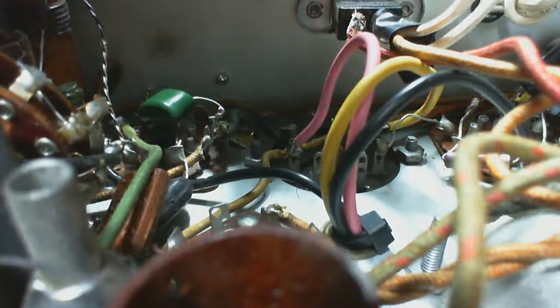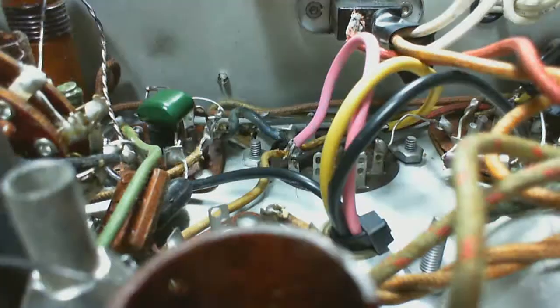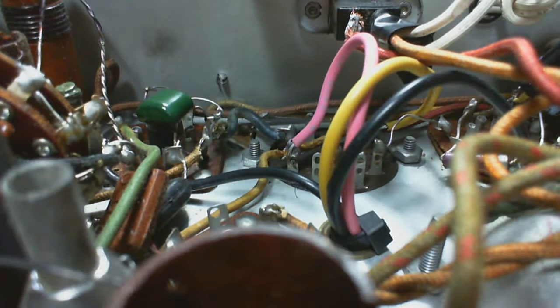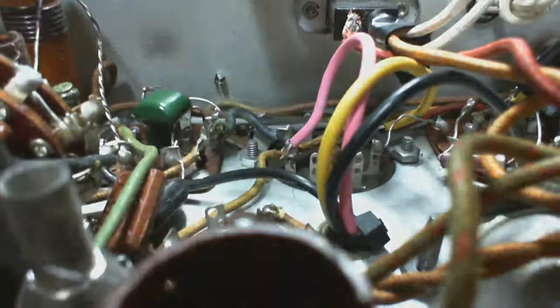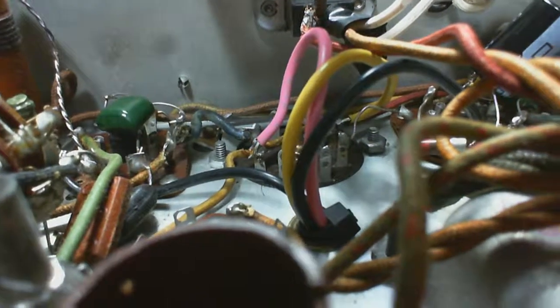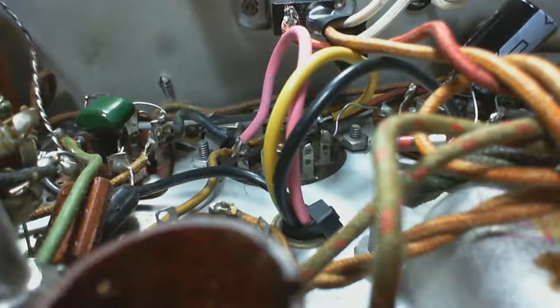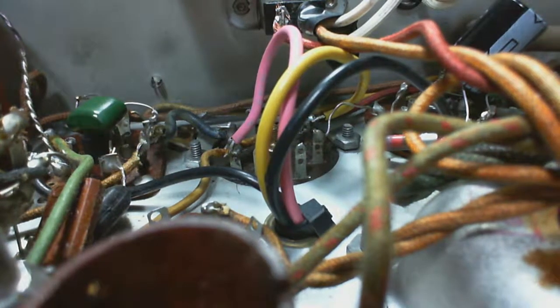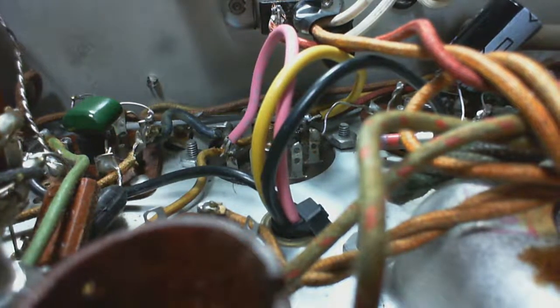And they're the kind of thing that'll generate a short circuit unexpectedly. And it's right on the power cord. So it would be up to my house fuse to interrupt the short at that point. Some people might be mistaken in thinking that if you have a 15 amp fuse, then you can't get any more than 15 amps. That's not true. You can draw like 15 amps for 20 seconds and they'll blow. And you can draw 20 amps for half a second. You can draw 100 amps through one of those things for a fraction of a second. I don't know exactly what the numbers are, I'm just kind of making those up.